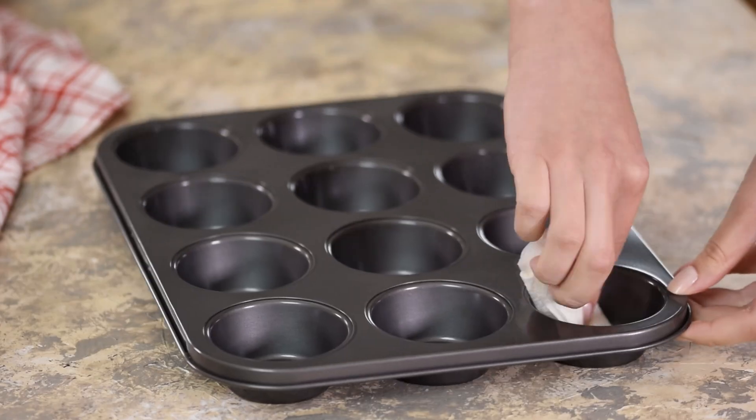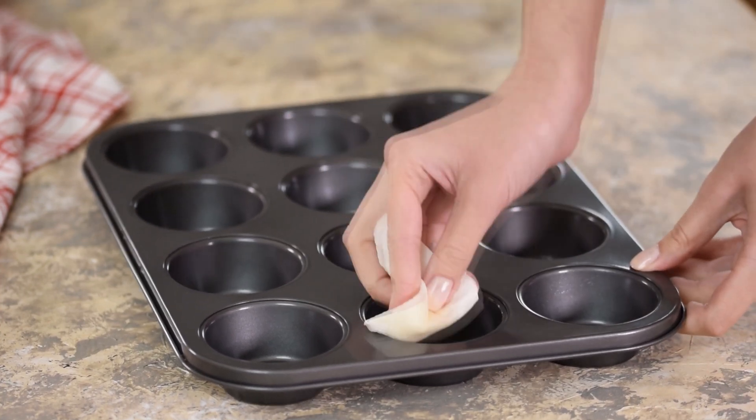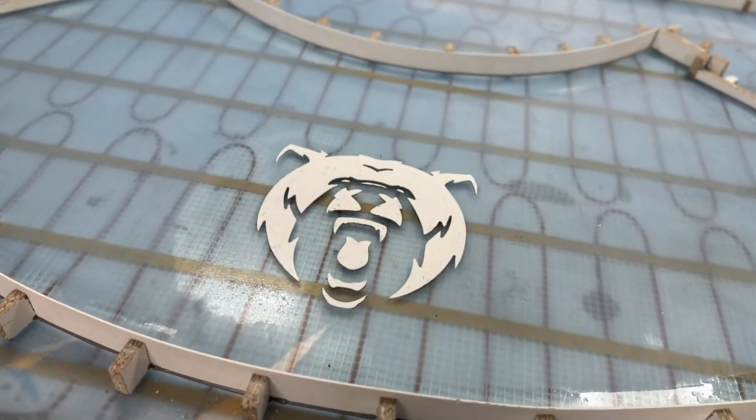So what is mold release agent and what is its purpose? It's as simple as the name, really. You apply a mold release to your molds so that the concrete will, once it's cured, release from it — meaning that none of the concrete will stick to your mold material. You don't want to go to the effort of building a fantastic mold, pouring the concrete in, and then when it comes to demold, have a bit of the face of the concrete rip out on the formwork, on the sides, or on the base of the mold.